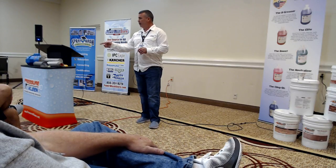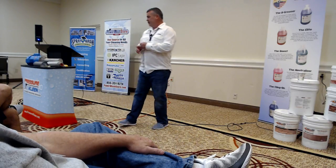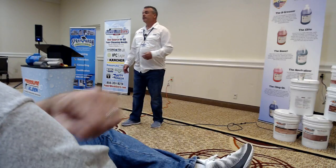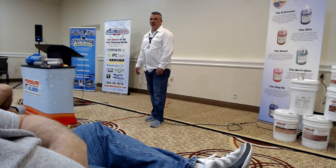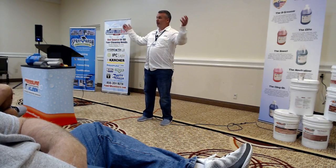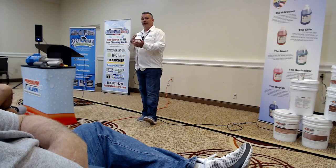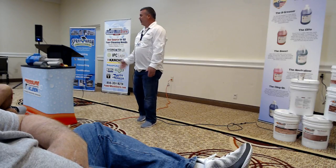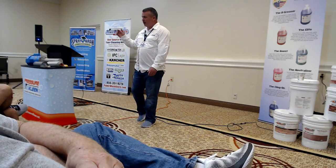That's a good point. A friend of mine brought me one that I sold him. It was a 7 GPM, one horse, 16 stage, and it's strong. He said, man, I've got to use this just for rinse because it puts out way too much solution. But he said my guy said it just kind of gummed up and jammed up and wasn't running. I said, well, what happened to it? He said they didn't put the lid on, and I parked it where I normally park it, and it got full of pine straw. I was literally getting pine straw out of the impellers, and the sap that was in there was incredible. Everything was tacky. And the poor pump, it wasn't its fault, they were trying to run pine straw through it. So I got it all cleaned out, fired it back up, and it works like a champ.